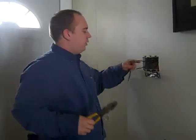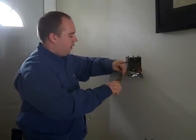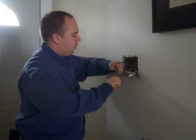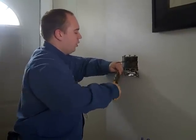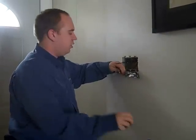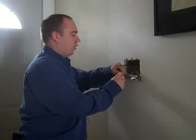I'm just going to take my aluminum wire, which I've already stripped, and add a copper wire to it. I'm just going to twist the two wires together, making sure that I do not over-twist the aluminum, because aluminum as a metal is fairly soft — if you twist it too tight, it will break right off and things will not work.